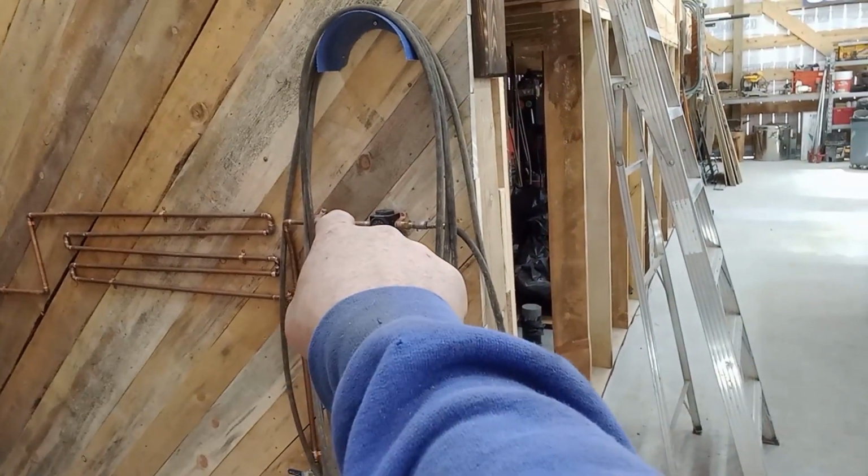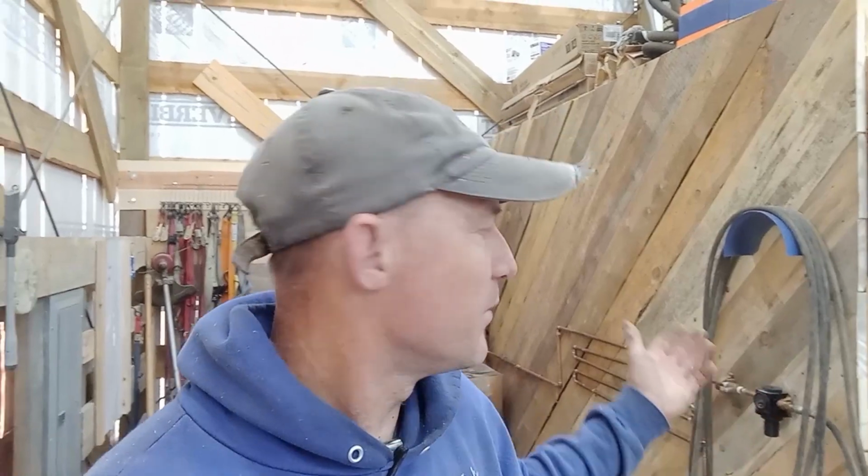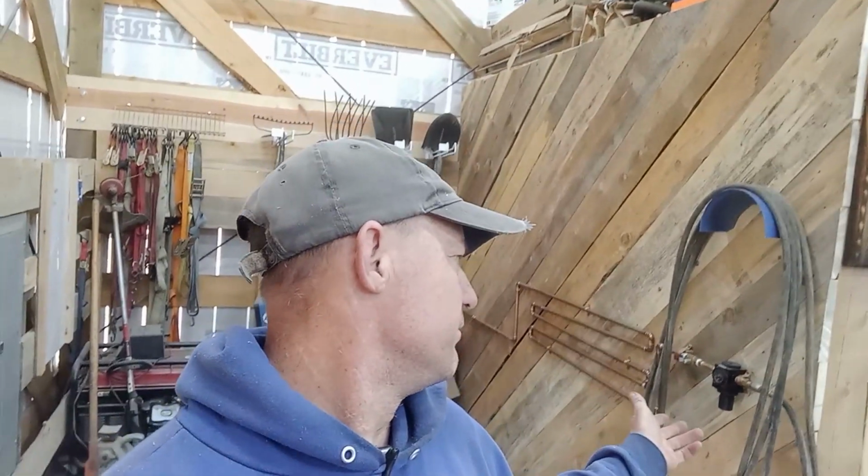That's a pressure regulator. The pressure regulator is there because that air compressor pressurizes, I think it turns on at 140 PSI, turns off at 175 PSI. I don't want 175 PSI coming through my airlines. So I bought the pressure regulator. I think I have it set at 120, 130 psi. Air compressor turns on at 140 psi. This is 120 psi. I haven't noticed a drop in pressure. The air compressor keeps up really nice.